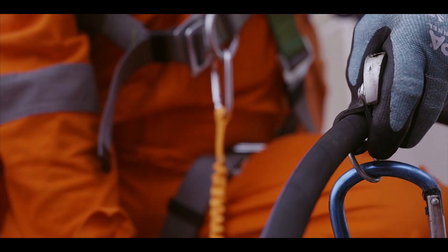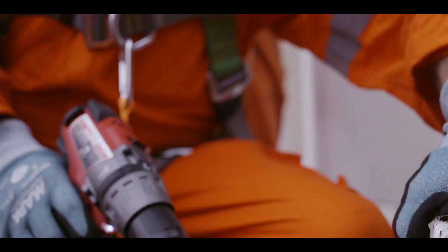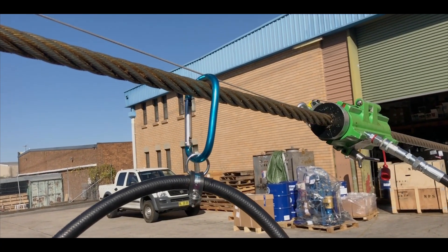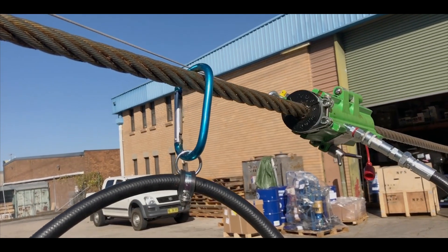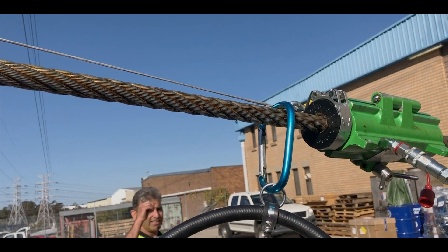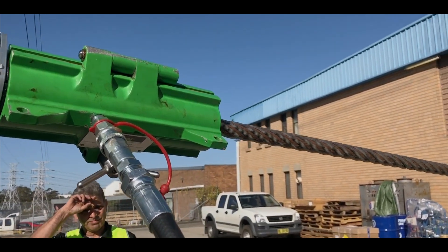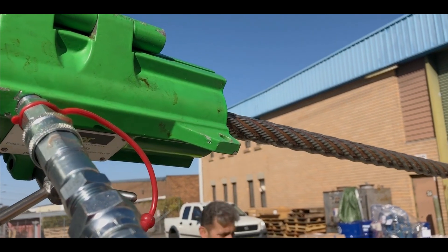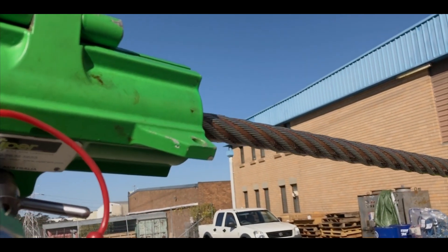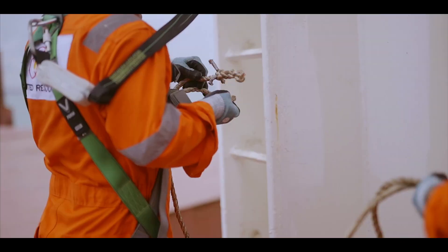Note, in this instance, we chose to connect the carabiners directly to the collar. Here's an example of the Viper Bulk Carrier System in use on a test rope with a rope cleaner attached. Viper Rope Cleaners can be used if the ropes have a build-up of external contamination — the rope cleaners enable superior lubrication and penetration to occur. Note, drop sheets may be required to contain the contamination removed by the rope cleaners.